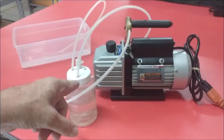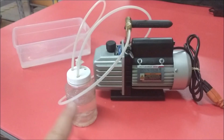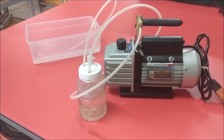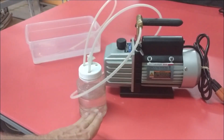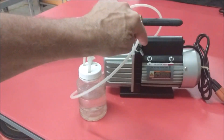You can regulate the speed with which it's coming back into the contained vessel by just jogging your finger on or off of that hole. When it's getting closer to the top, take your finger off. Simple. Turn the pump off. Dump it. Lather, rinse, and repeat. That is a great way to double utilize a vacuum pump to evacuate liquids as needed. Do not let the primary line from the vacuum pump go too far down, or as this is filling up, the line will engage the liquid and go into the pump. Don't let that happen. Vacuum pumps are for air, not for liquid.